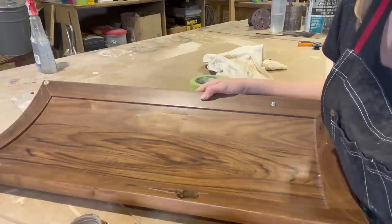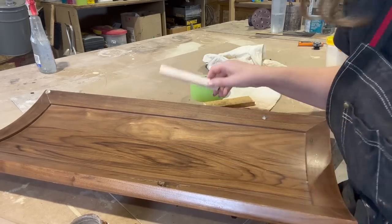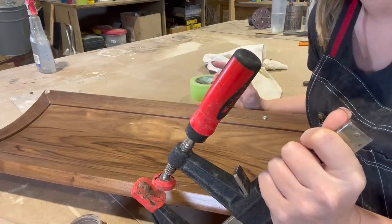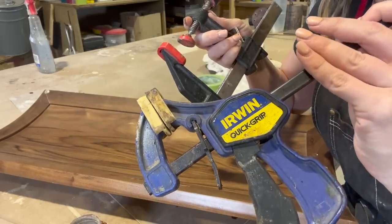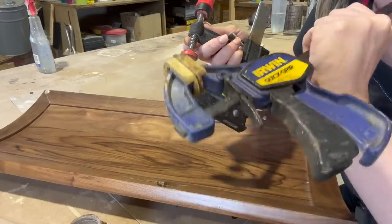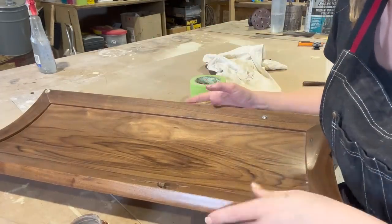And I will slide it into place as much as possible to get that better fit there, but it's gonna need pressure. So you need a good amount of, and these aren't actually that flat. I might pick up something else to put on here. But you need good clamps. These can put a lot more pressure on than my quick grip clamp. These guys, or even bigger ones, I can just really screw down this piece and really compress those fibers a lot more than I can with this. So choosing the right clamp to compress something is important as well. Get enough pressure on there.